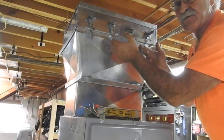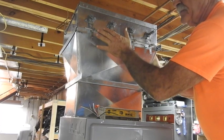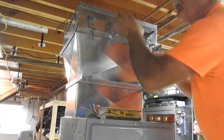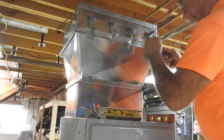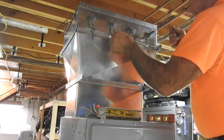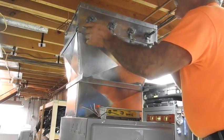Because these are not factory dampers — they're actually handmade — sometimes when you install them in a piece of duct there gets a little bit of a twist in them. So you have to make sure that before you cover them up they're still going to function the way you want them to function. I've got it marked clockwise to open, which means it's got to go to the left in order for it to open up. There they go — they're working fine.